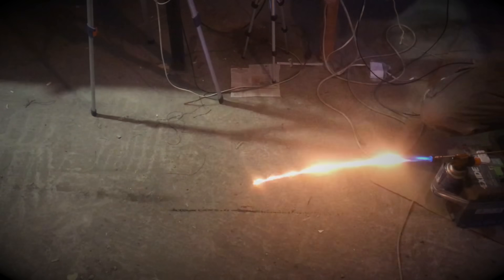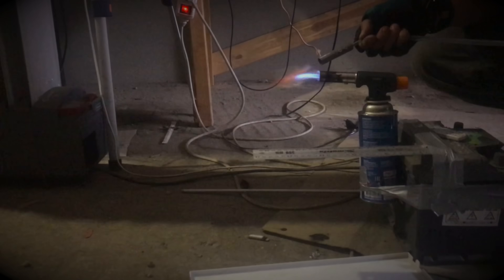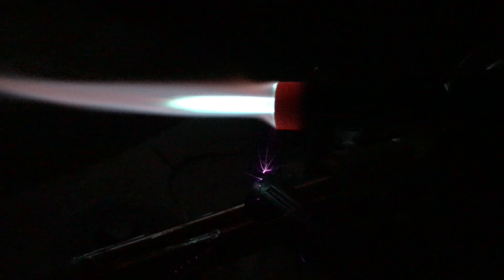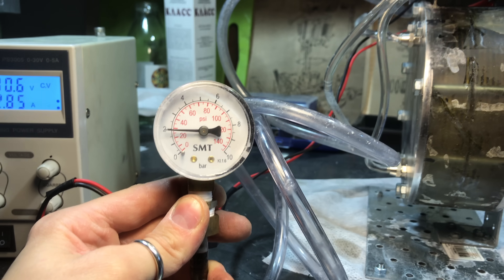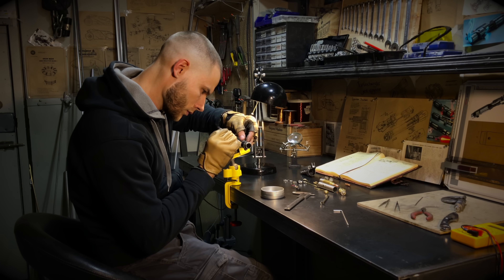We need a biblically epic fiery torch from our hand, burning everything like the Mother of Dragons, using brown gas as fuel with a combustion temperature of almost 3000°C. But hydrogen and oxygen burn fast — not just fast, but as Tarantino would say, damn fast. First, hydrogen with oxygen generated by electrolysis are two atoms with the ideal number of electrons for the fastest possible recombination, meaning ignition with minimal spark energy. Second, a mixture of hydrogen and oxygen doesn't need an external oxidizer like propane or acetylene — it already contains both fuel and oxidizer. This creates several interrelated parameters: gas generation rate, gas outflow rate from the nozzle, pressure in the electrolyzer, pressure after the reducer, and nozzle diameter — and all these parameters affect each other. That is the technical contradiction.